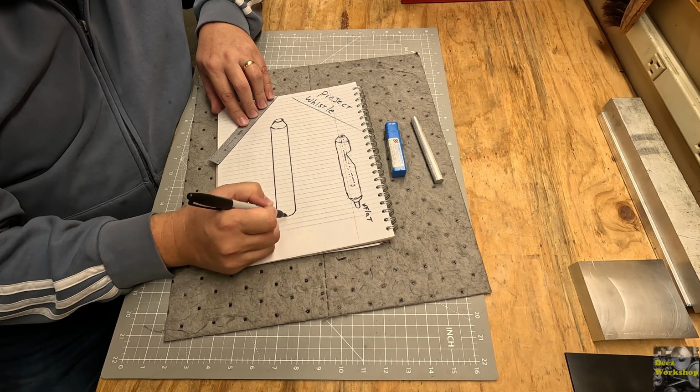I'm going to bring that in. I've got a 19/32 end mill. I was kind of wanting this anywhere between 1/2 inch and 3/4, but I think I need to cut into the center bore. So I'm going to go ahead and use this, about the right size of end mill that I had that I think is going to work out. So I think I want to come in about 19/32 from the end to where I'm going to make my tapers for the whistle portion.